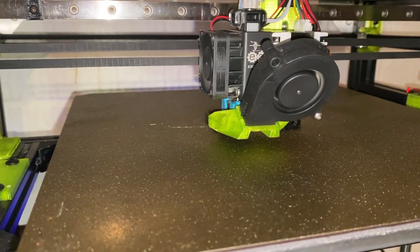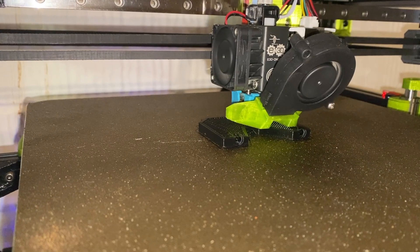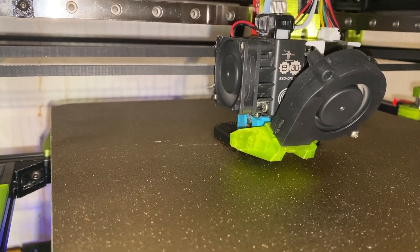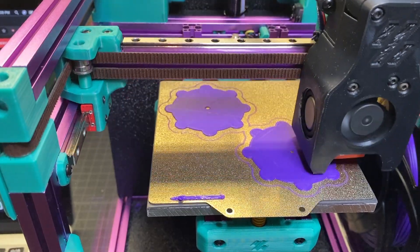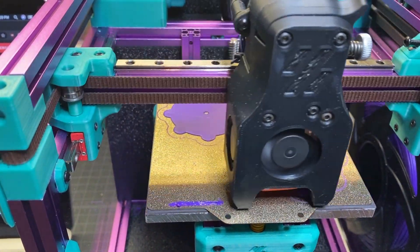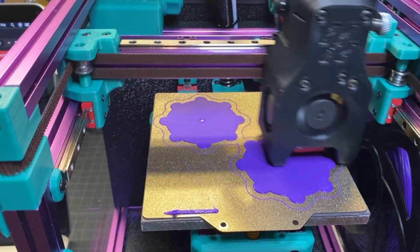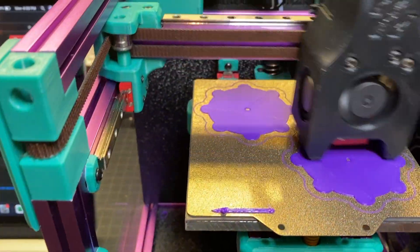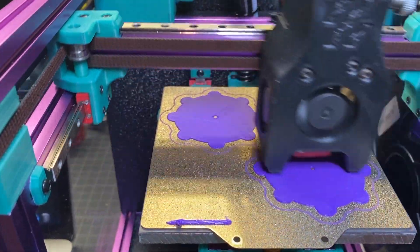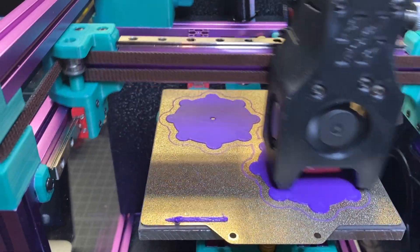The frame itself is very stable. This might be a little more typical of what you would see on a larger printer — maybe 1000 acceleration at 60 millimeters per second or so, I think is what I had this one set up. Now we are starting layer four. Still getting some really rapid movement. Now we're actually hitting the full 160. I'll show you my slicer settings here in a second.